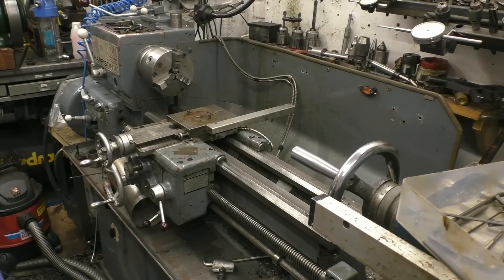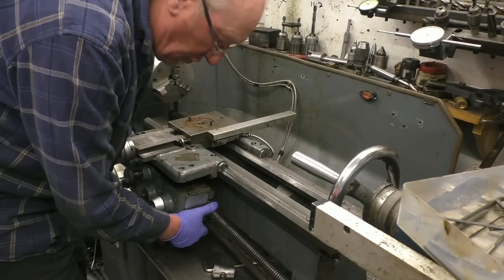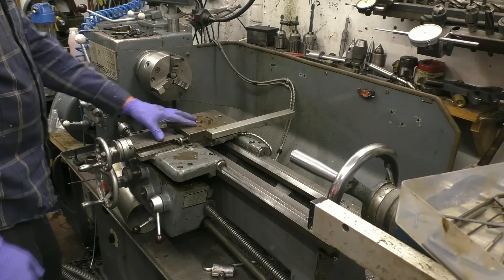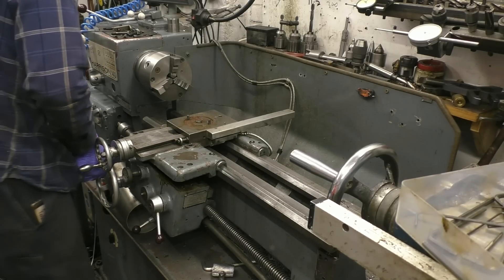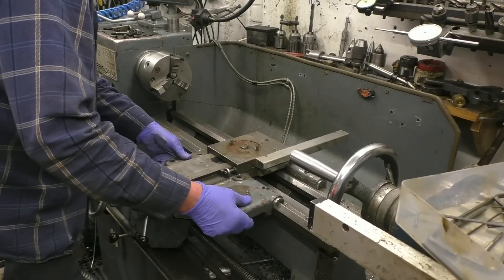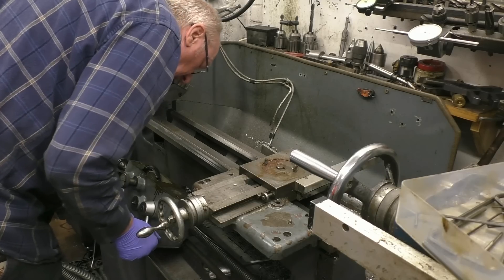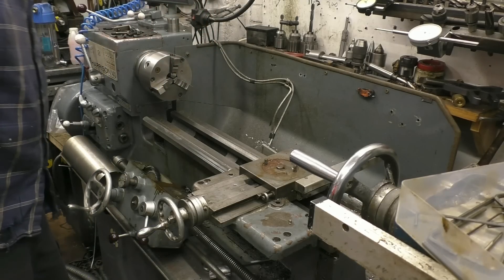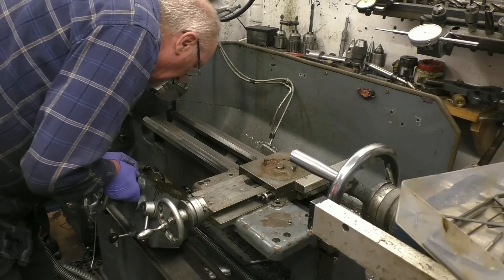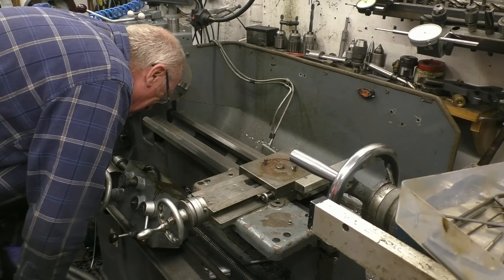I've done a little bit of Googling and what you have to do is disconnect the two feed shafts from that end, and basically the apron comes off the bottom like that. I've got it wedged up on a piece of tube so it doesn't fall all the way off. You can leave all this attached and the apron comes off the bottom — quite a heavy, fearsome thing it is. So you can see what's gone wrong in there. I'll bring the camera in for a closer look — something's obviously come to bits. I don't like what I'm seeing here.